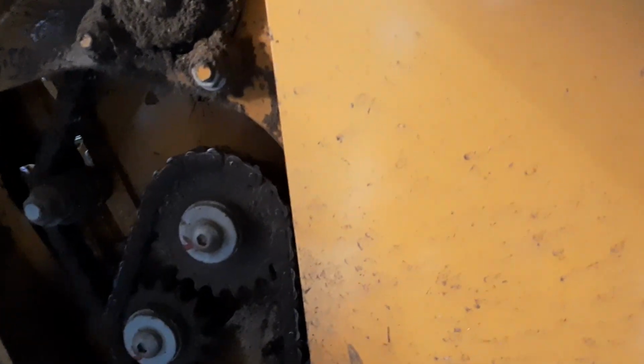But I think I kind of changed the setup in here a little bit too. On our old Super M, there wasn't a greasable bearing here at all. This bearing needs grease right here. But I think it's a little bit different here because of that clutch, so it does affect the design here. That's the biggest change from our Super M.